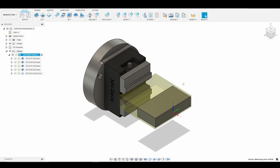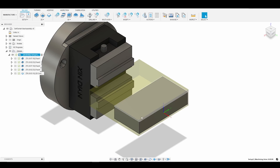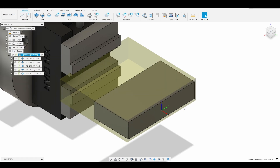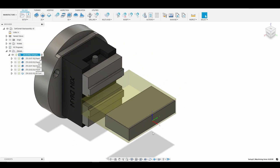One of the first things we want to understand is our work coordinate system, or how we're going to set up our CAM operations. Typically I was used to probing the corner of the stock or a soft jaw to begin machining. It's different on the fourth axis in that everything revolves around the A axis center of rotation, which is in the center of our material and in the center of our Micro Arc fourth axis. That center is actually in Z and Y. Tormach does provide a probing routine, which we'll go through in a few minutes, to set that center of rotation.